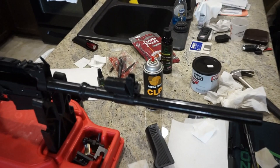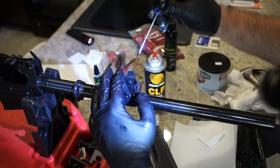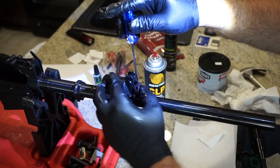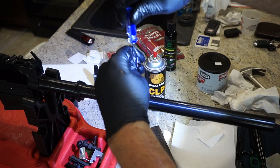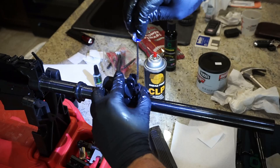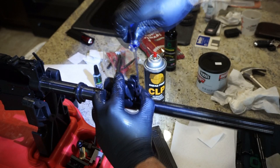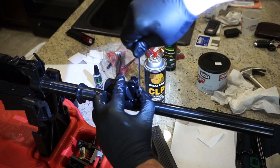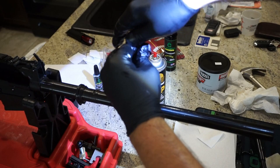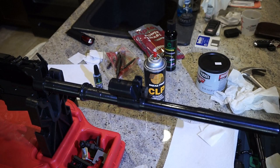This next part could be a little bit frustrating. We've got the zero on top and our mark towards the bottom. We're going to screw the screw all the way through — this has to be basically lined up perfectly or it won't go, so you might have to fiddle with it a little. I had to press in just a bit to get it to seat properly because of some spring tension. Once that stops, don't overdo it. Ensure that it does rotate — press back on and turn it. We'll play around with it a little more once we get the gas tube back in. Let's go and put the lower handguard back on.